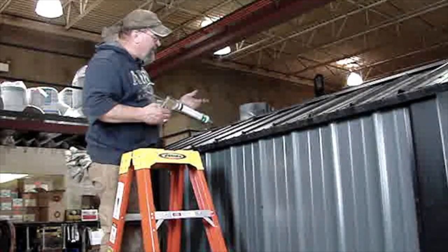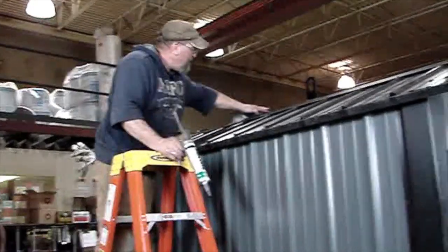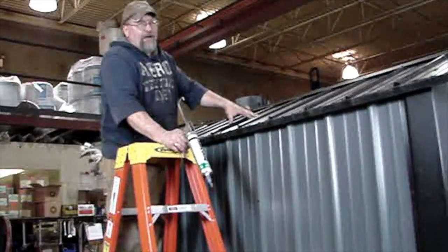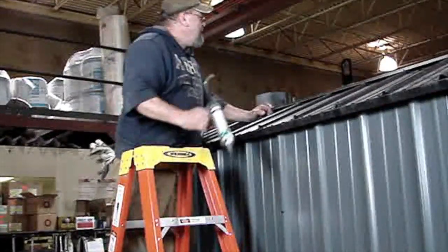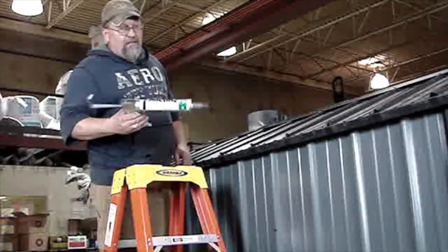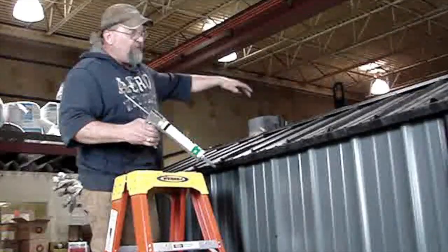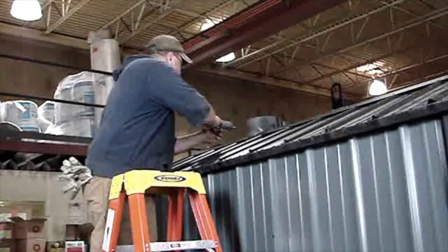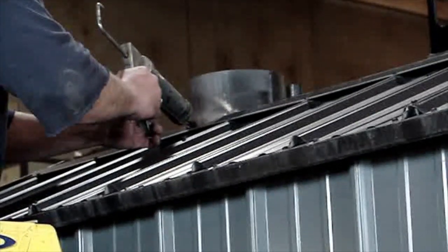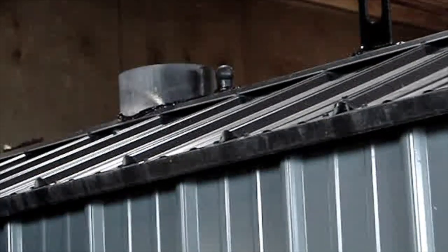Okay, now what we do, the last and final thing, is to re-silicone around our chimney, our pop-off ball, our standpipe, and new furnaces do not have an anode rod. So there's a hole on the other side in your roof where the anode is. We'll send adequate silicone with it, and just silicone that 1-inch hole shut in the roof of the stove on the other side. Reinstall your pressure relief ball and you're done.